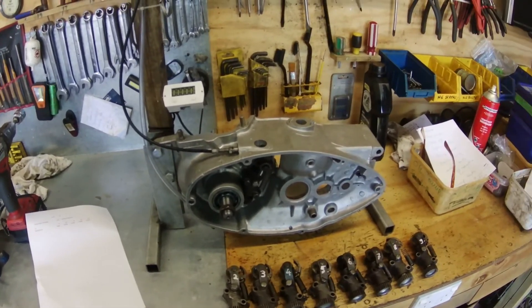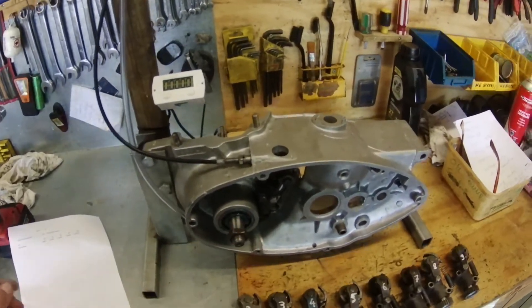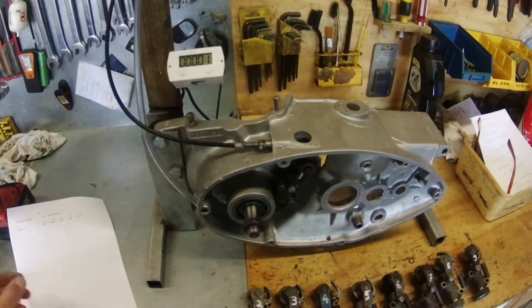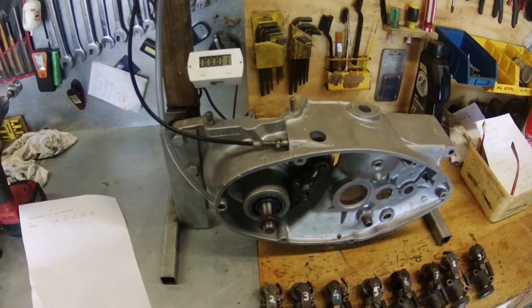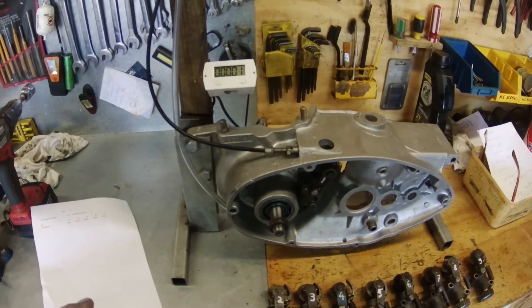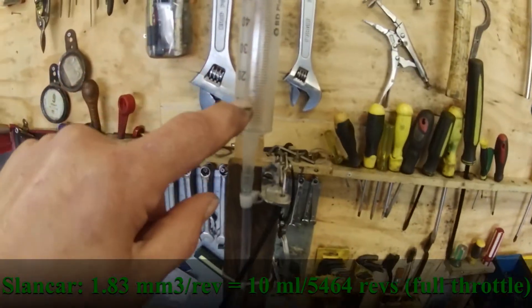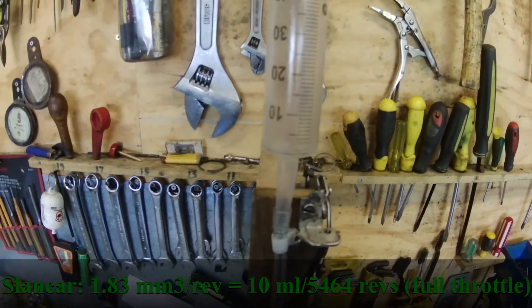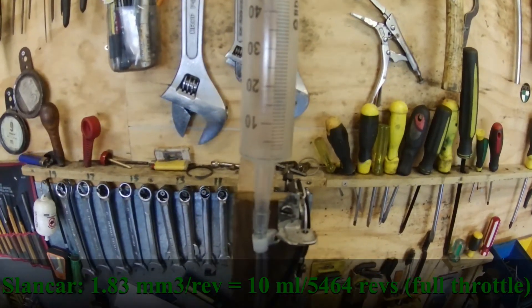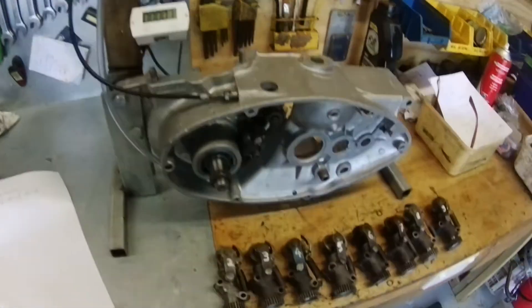I also want to test the amount of oil that's actually being pumped. From the Slankar book on the single-cylinder engines, he writes that there is 1.83 cubic millimetres per revolution. So I calculated that if I want to pump 10 millilitres of oil I need 5,464 revolutions, or for 20 millilitres, 10,929 revolutions. I'm going to do that for all of these oil pumps and check whether they're actually all working.